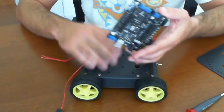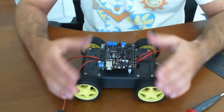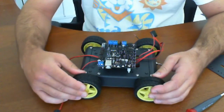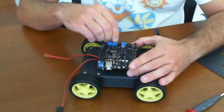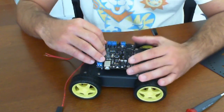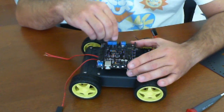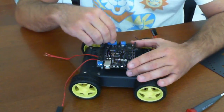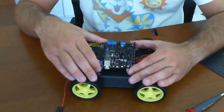We don't like to mount things flush to metal — especially this won't work if you do that. The reason why we chose this board for this project is because it came with programmable buttons to do different things, as well as power for the motors, which is very important. If we didn't purchase this one, we'd have to buy a motor shield separately, which we didn't want to do.